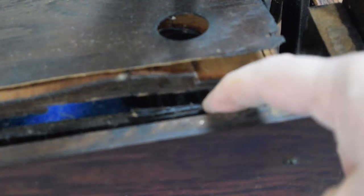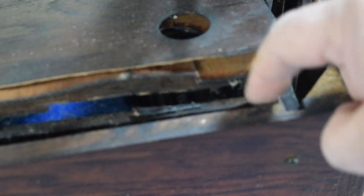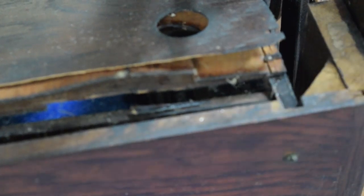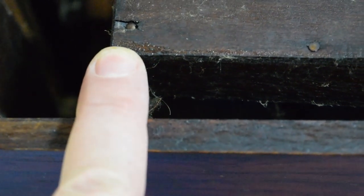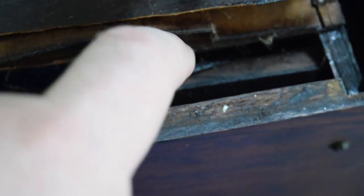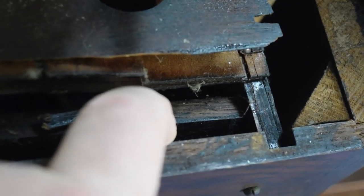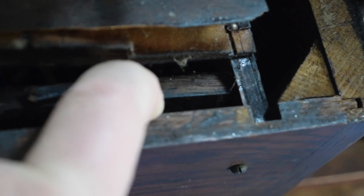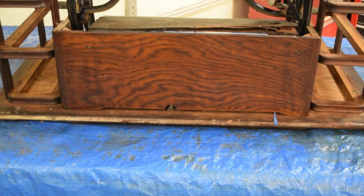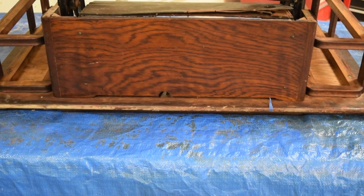Looking down, this piece of wood here is what the back of the cradle is supposed to nail into, and it is broken away. And if you look here on the left side, we have this much space. And as we traverse, you can see that this underlying piece of wood that it nails to has broken away and come in this direction. So we're going to have to take that apart, identify why that has moved, try to get it back where it belongs, repair all of this plywood, and then reattach it. So this will be a little bit challenging. And the back portion of the cradle case, I guess we'll call it, is in pretty good shape.